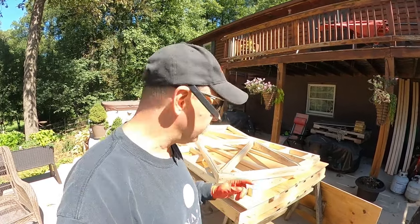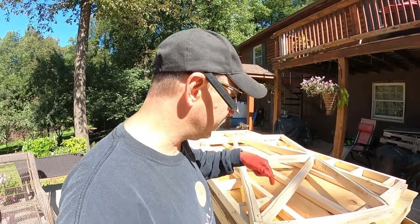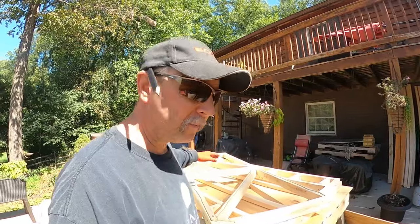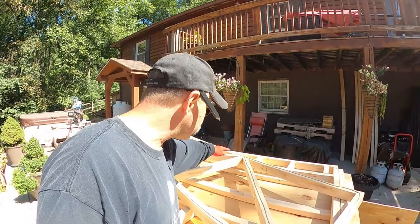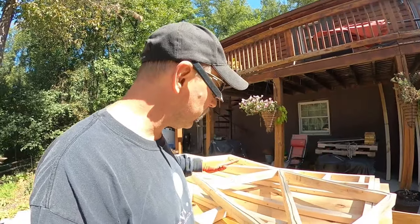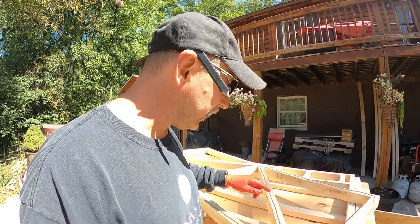So we went ahead and we built the door. And you see, we got the glue on here. We're gonna get ready to nail it down. A little tidbit here is what we did, both Bob and myself. He's actually the brains here. We built the frame, put the door up here, and put the frame down. We cut our cross braces here. These cross braces are for stability on the door. Put it all together, put the plywood on the door, got it all squared and ready.